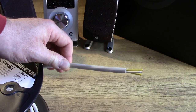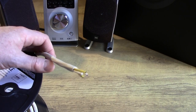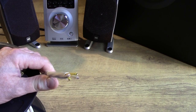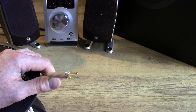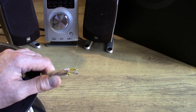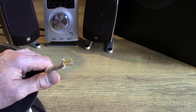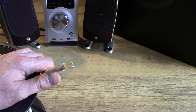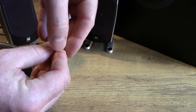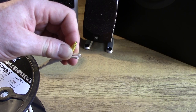The cable is very basic looking - it's meant to be hidden, so you don't see it. It's not supposed to be flashy Gucci cables for your hi-fi system, but it does its job well. This particular cable is a 14-4 gauge cable. It's called four simply because there are four of them. When you have four conductors rather than just the two wires, the gauge is actually dropped by three places, so it's actually the equivalent to 11 gauge cable, although Kimber actually sell it as 12 gauge. Kimber do tend to be conservative with the rating of their cable. Because there are four, you could either use it for two speakers, or you could use it for bi-wiring, or for bi-amping. Or you can actually twist them together, which is what I'm going to do.